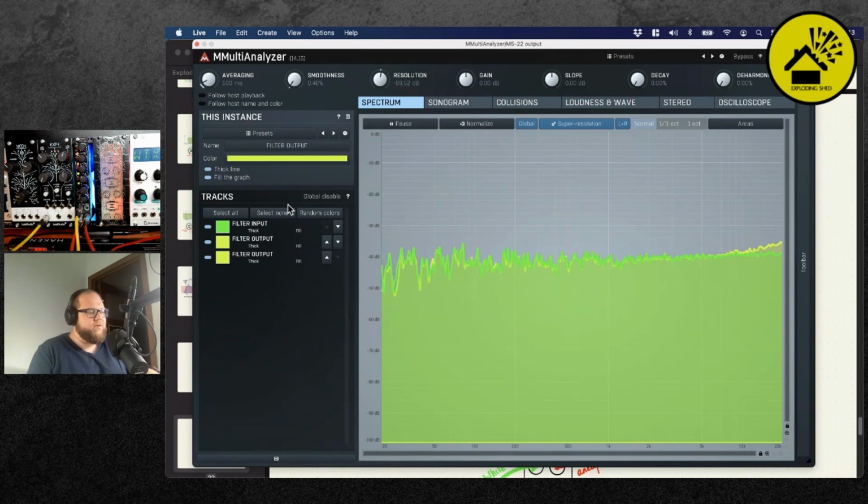And then if you turn it further, it will start to act as a high-pass filter. And this is behavior that you need to remove with the offset and the trimmers. But when you start the calibration, just turn the high pass up until it's completely flat and do the low pass filter first.